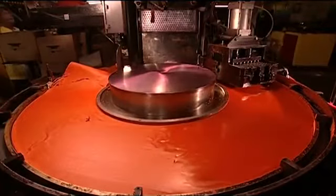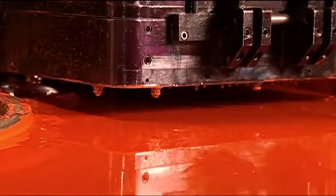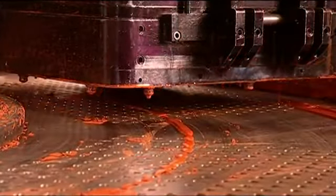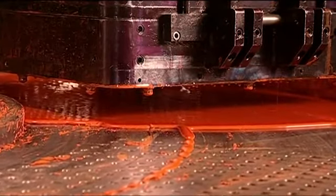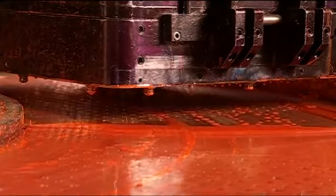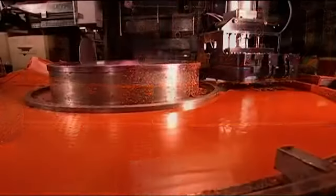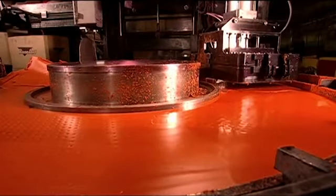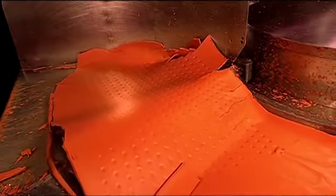Now the wax is pumped into this device, called a rotary machine. It first injects the wax into crayon-shaped moulds. Then, it envelops the moulds in cool water, hardening the wax within 60 seconds. As the moulds continue along the circuit, a blade scrapes off the excess, which gets recycled.